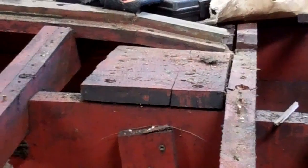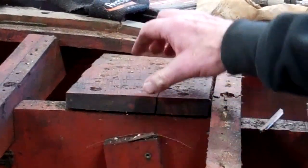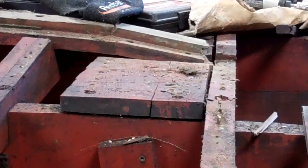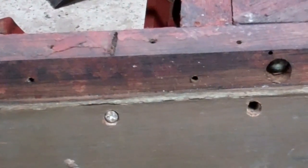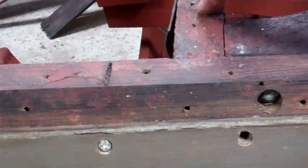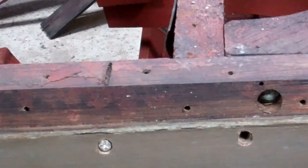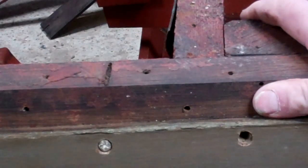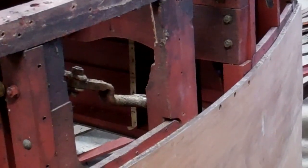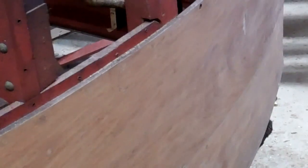Now we have access to this plank, and as soon as this section of the chine plank is released, we'll be able to release this frame as well. We have to do the same on the other side. In the transom, now that we've got things really opened up, the only way we can handle this center brace and replacing it is by releasing the next two planks.